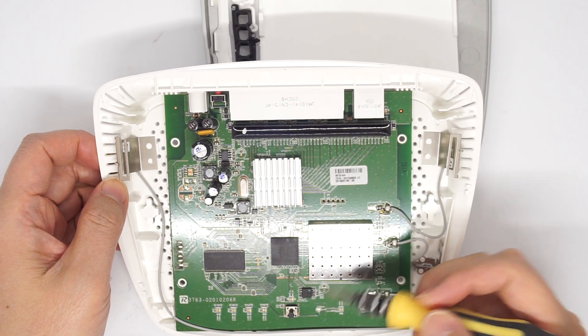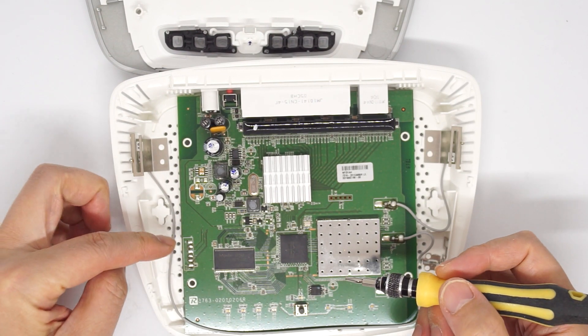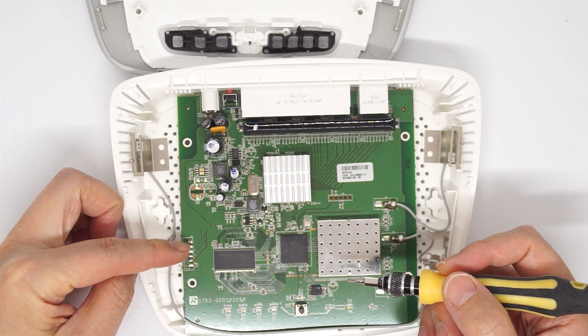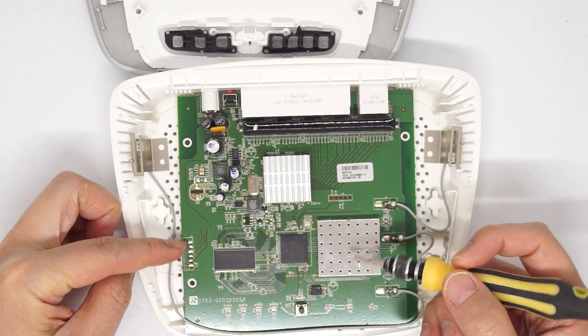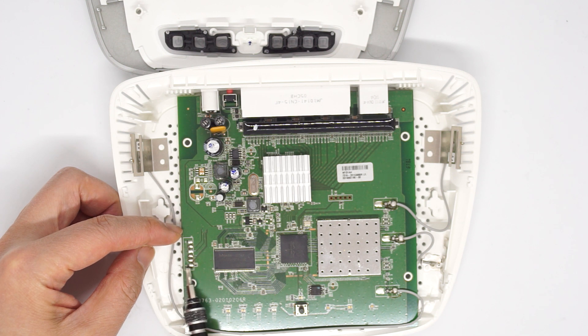This is the SPI chip. This is the JTAG port. On the front side are the signal pins and on the back are the ground pins. The first pin is TRST, then TDI, and so on.